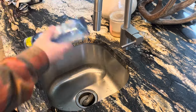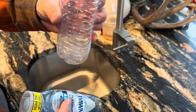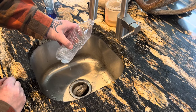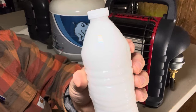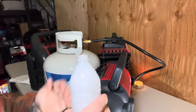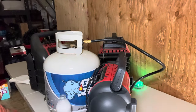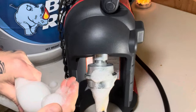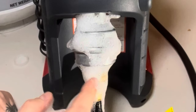If you're worried about gas leaks, here's a free at-home trick. Take a water bottle, add just a tiny squeeze of Dawn dish soap — less than a teaspoon — then about an inch and a half of water and shake it vigorously so it foams up. Make sure your tank valve is fully open. Then squeeze the bottle to get some bubbles and smear them all around your fittings. If there's a leak, it'll bubble up really fast.